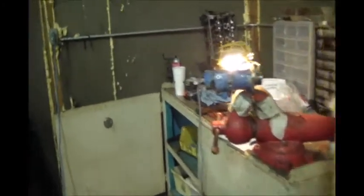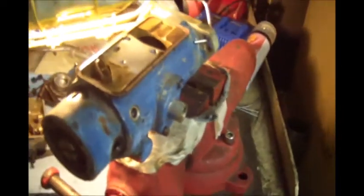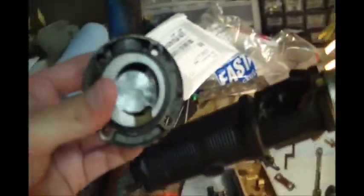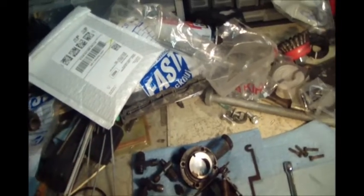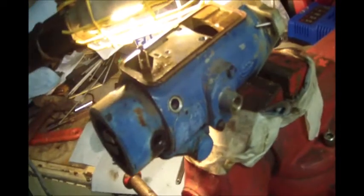It's about 60 degrees in here right now — my phone says it's 35 outside. It's about eight o'clock on Sunday, November 1st. I went back to the house to get the camera — I came out here and forgot it at first and got started. I did want to show this: I've started to get this injection pump apart and I think my problem might have been a clog in this assembly coming down through here. I've already taken this apart and it does seem like it flowed better after I put a little fluid in it.